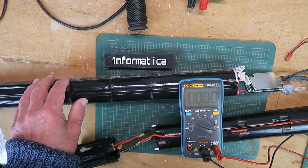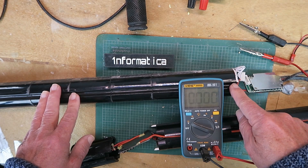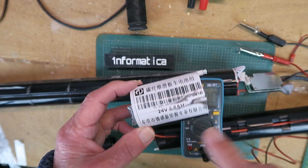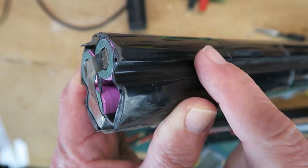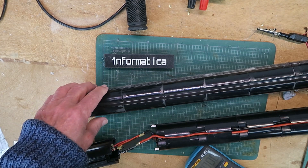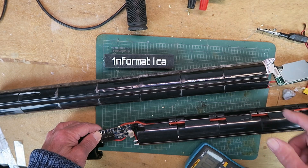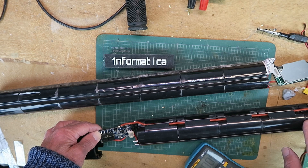This is the battery pack out of the white scooter. Using the same method, probing with my pins carefully in the balance connector, I have discovered that in this pack there are in fact three sets of cells which are completely duff. Looking at the battery here it says 6.6 amp hours, so it's no surprise when we look in the end that there are three cells in each of the packs, making this a 7S3P battery. I had hoped to close out this video with something working, but I can't just easily swap the BMS boards between the two, as in true Chinese fashion the balance leads are completely the opposite way round — the positive and negative are reversed. Rewiring that would be an absolute nightmare, so I've had to order a new BMS and there'll be a follow-up video when I fit that. Many thanks for watching.